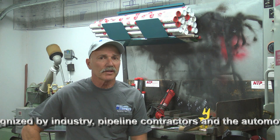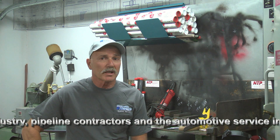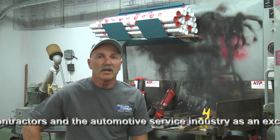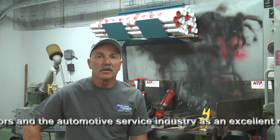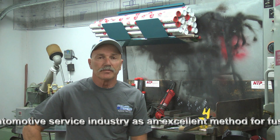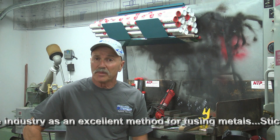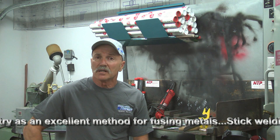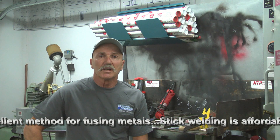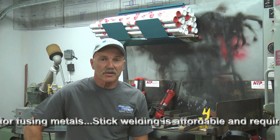When it comes to equipment, you have a variety of choices — everything from a buzz box AC welder without DC provision, to a full-on AC/DC welding outfit, or even a portable generator and welder combination. If you're on a budget, I would encourage looking for a buzz box — something like a Lincoln, Miller, or Hobart — that has been treated properly and is still in serviceable condition.